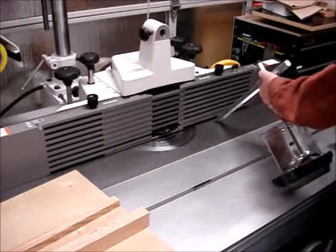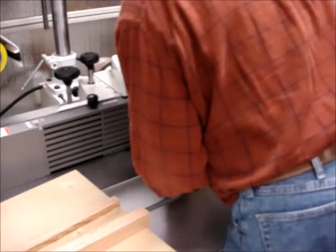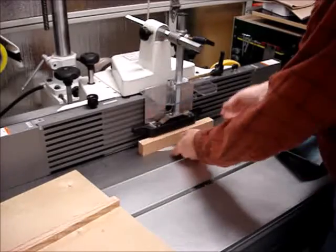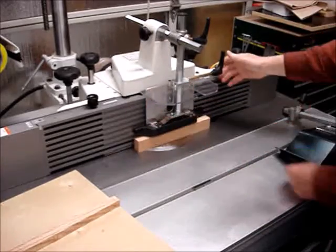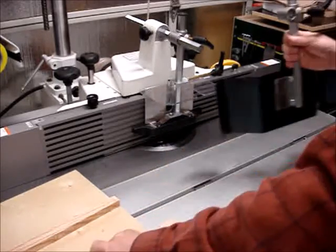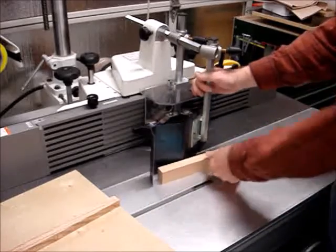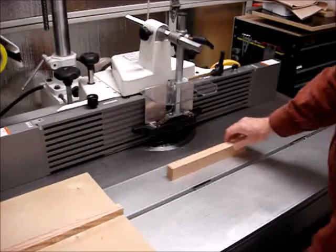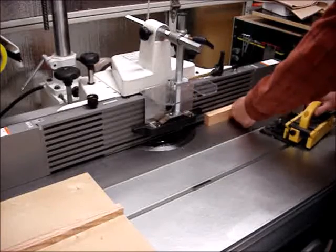Now that the bridging is set across the opening in the fence, I need to set up my hold-down. I'm more concerned about the hold-down with the shorter piece. Adjust it just to get it holding down — it doesn't have to have a lot of pressure, there is a spring load there, but you don't want excessive friction when you push that through the cutter. This device also has a spring hold-down to hold it up against the fence. I'm not going to use that on this one because the workpiece is so short — I'll put this aside. I'm going to be using this gripper to guide the hardwood through.